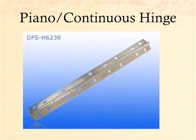A piano or continuous hinge — either name is acceptable — is a long hinge coming in various lengths, usually ranging from 18 inches up to 6 feet. The advantage is if you have a long surface area that needs to fold or bend, like up the edge of two flats, a longer hinge gives a sturdier surface. One of the nice things is you can cut piano hinges into smaller hinges at where the barrel breaks are between the two halves, making them extremely versatile.